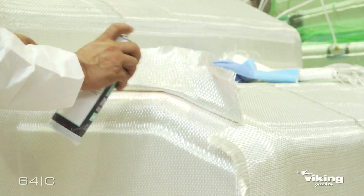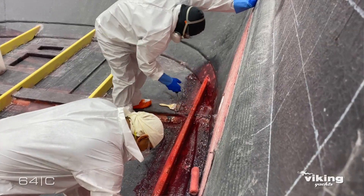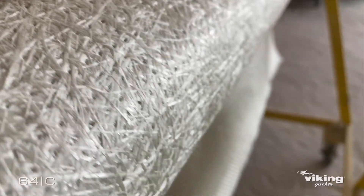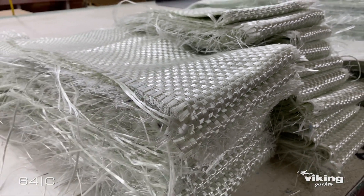There are some places where we'll use customized fiberglass materials and reinforcements. We've gone through the years from just using a conventional fab mat, which is a 24-15 woven material, to hybrid materials to carbon fiber.